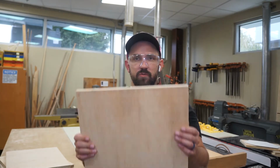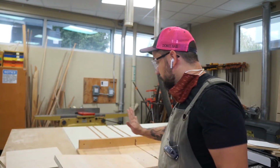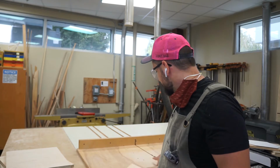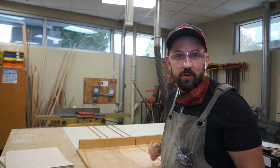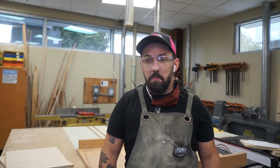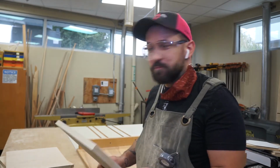And then I'm going to use that as the bottom that I'm going to put on a board that I'm going to screw onto my crosscut sled here as a little bit of a shortcut, so that I set the board at 120 degrees from my table saw blade. I know there has to be a better way of doing this. I don't know it necessarily, but in woodworking there are about a dozen ways to do any given thing, and this is the first way that came into my mind, and I don't foresee any problems, which means I probably should be worried. Okay, wish me luck.